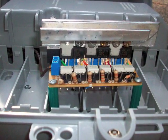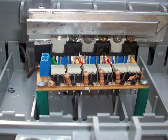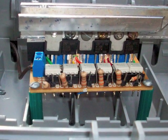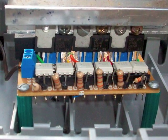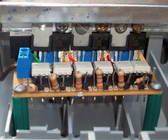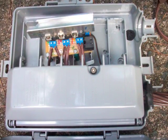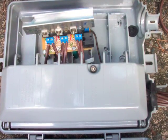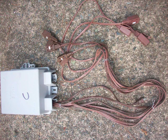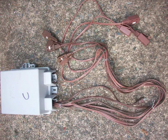Sean provides PCB board layouts, but I manually made all mine, which allowed me some freedom to make changes. Since I'm using CAT5 Ethernet cables, I could theoretically control seven segments via each cable — that's one common and seven data signals. My board layout worked best with six channels per SSR board. I bought extension cords, cut off the plugs, and connected the remainder to the board. One or two SSR boards were mounted in a waterproof surplus telephone box, and these boxes are mounted to the two trees behind each man. An extension cord is routed to each individually controlled strand of lights, including the snowballs.